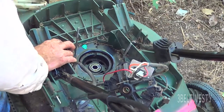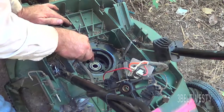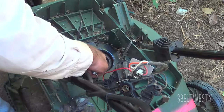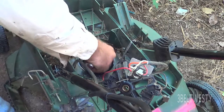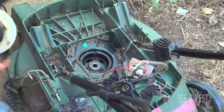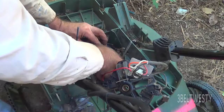There's the bearing - it looks like the same bearing that's on a car alternator, it's actually got a ball bearing. What I've done is gone in with a pocket knife and just get past the seal just a hair, and I've taken some motor oil and got it in there past the seal. You can also try to just pry the seal off, but I just want to get a little bit of oil in there - it probably hasn't been oiled for 20 years.